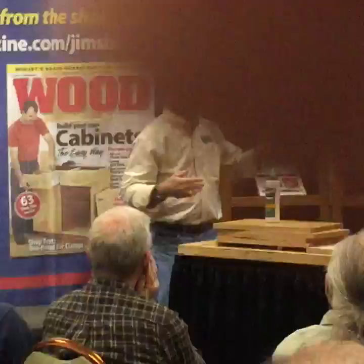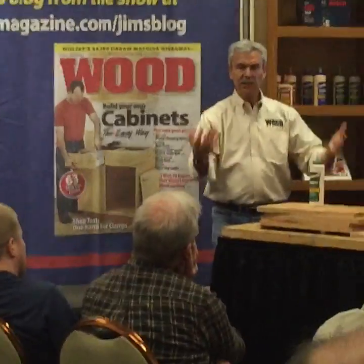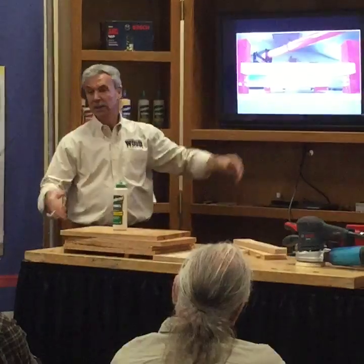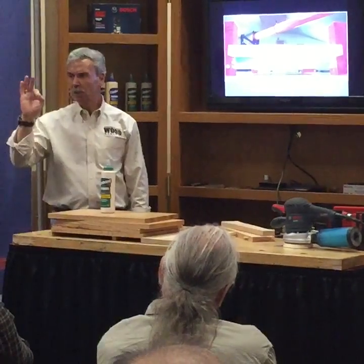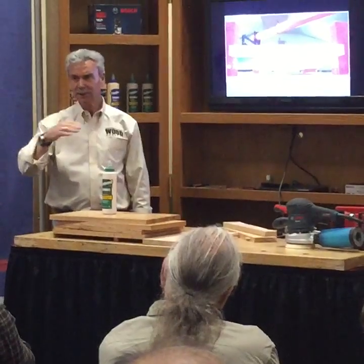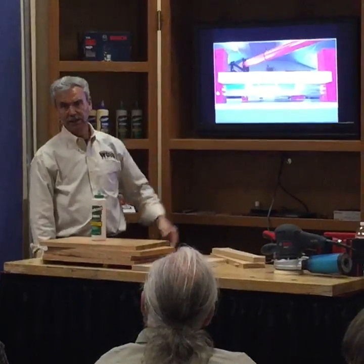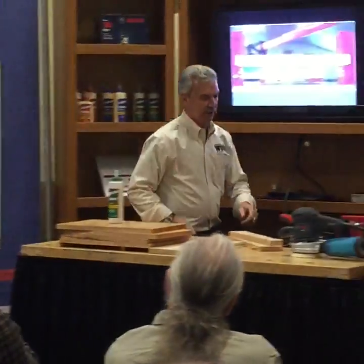And again, in my work mind, if you put this under tension, something's got to relieve that tension. The board bowed up. It's the only place it could go. On the old pipe clamps, you actually bent the pipe. I don't know if anybody's ever had the little 1/2-inch pony pipe clamps. They're really pretty cool, but the pipe actually bends if you try to do a real long glue up. This will stay nice and flat. So the key in this is just that a turn is plenty.